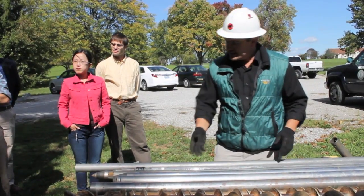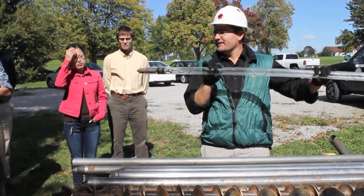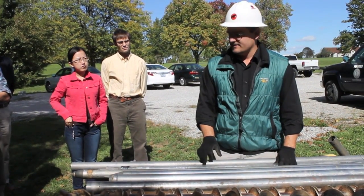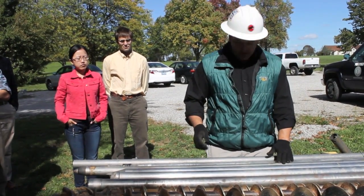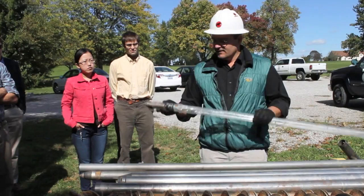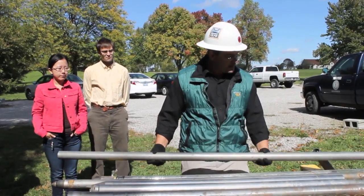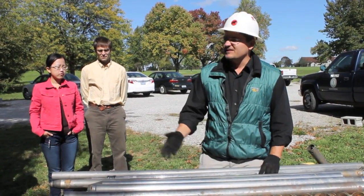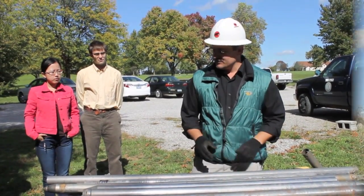The piston tube is actually inside the outer casing. For lake coring they make polyacrylic tubes like this — they just push the tubes through the mud and they're really strong. These are weaker; you can cut them with a razor knife. The issue is the piston takes up space. This is five feet or 1.5 meters, but I can only drive 1.25 meters or about four feet. So I recently had a custom barrel made at almost six feet. I have to order liners at this length, but then I can get a full 1.5 meters per drive. The piston takes up space at the top — it just cuts down on your time. The fewer times you have to go in the ground, the more continuous your core; you don't have to worry about overlaps or slop in the middle.